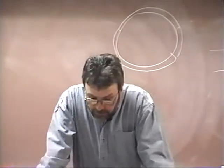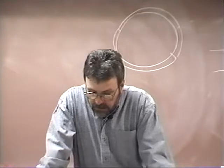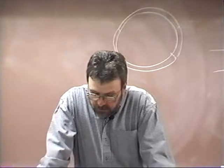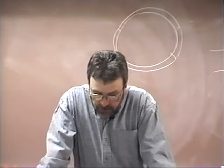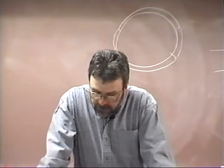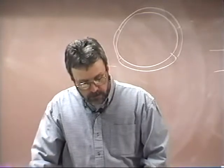The principal guide for welding pipelines is the API Standard 1104, a document written by representatives of the API, AGA, PLCA, AWS, and SNT. This standard provides the requirements for obtaining weld joints of adequate quality for gas and crude oil transmission pipelines or other high-pressure services using skilled welders and commercially available materials and equipment. API 1104 also outlines the methods of testing and the test requirements for qualifying welding procedures, as well as materials for a specific kind of pipe size and joint.